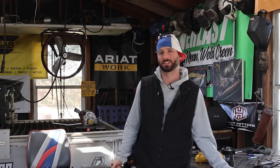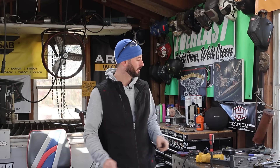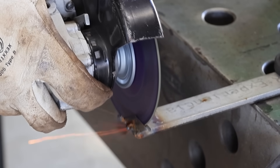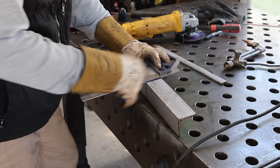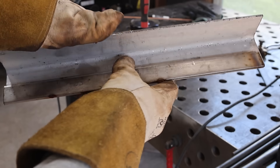You really can't beat the classics - just a simple piece of angle iron with a piece of flat bar tacked at the right spot so that you have the perfect offset for your cutting torch, whether you want to work at an angle or a straight 90. That's pretty much what this first burn bar does. You can check out the video that Bob did years ago when he builds his classic burn bar - we're going to do nothing much different. We're going to start by cutting this flat bar with the Cubitron 3 cutoff wheel - these things are good enough to cut through the stainless pretty quick. Once we get that done we'll line it up to get equal lengths, then we'll cut this piece of angle iron too.